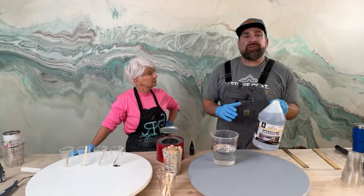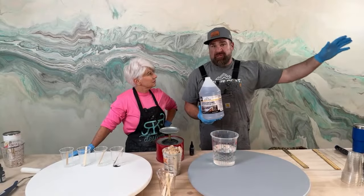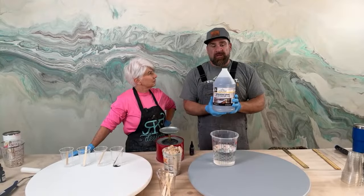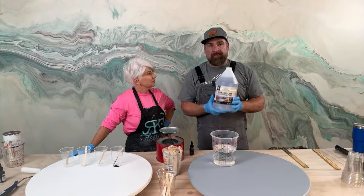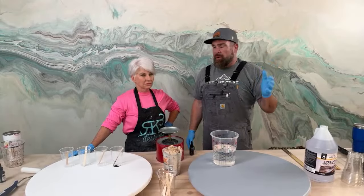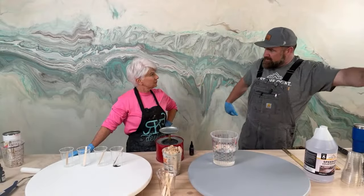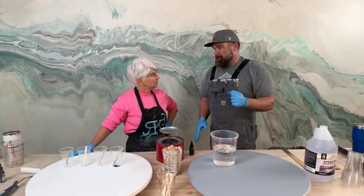So you're not going to want to do white or light colored countertops because 5 years down the road, you'll start getting that ambering from epoxy, especially speed set hardeners are more prone to that. But we have crammed the most UV resistance into this bad boy. I've done half a dozen or eight or so projects with this. I've done big 8-foot by 3-foot islands, and I've done two at a time. And I had about 25 to 30 minutes of working time.